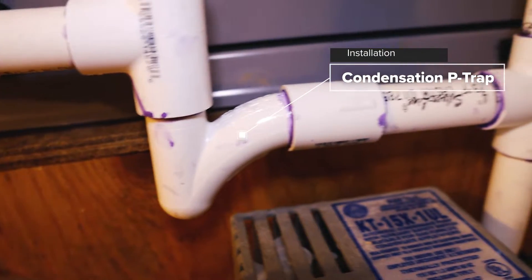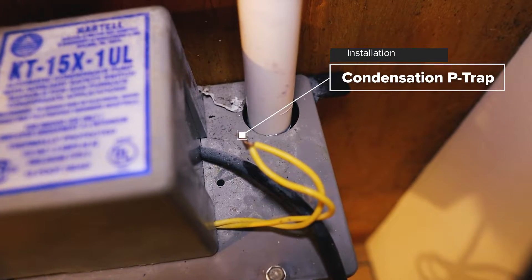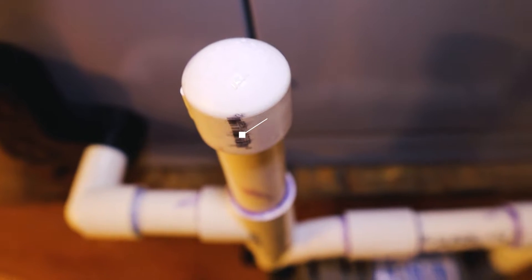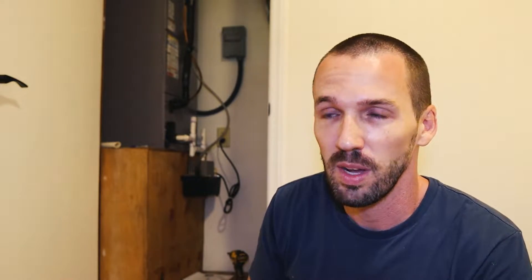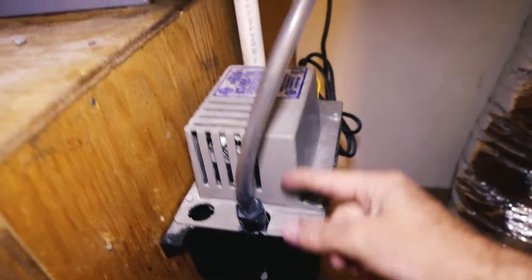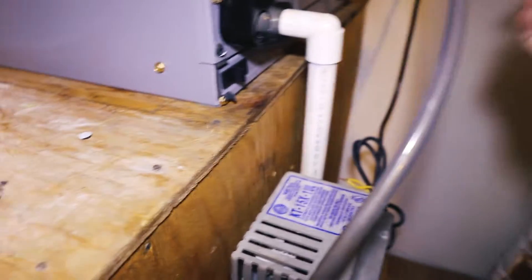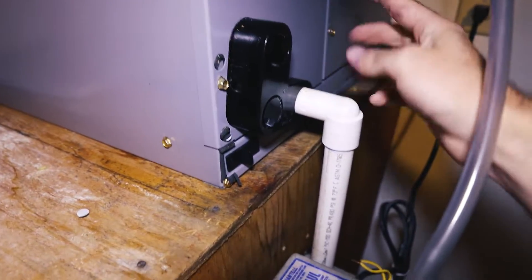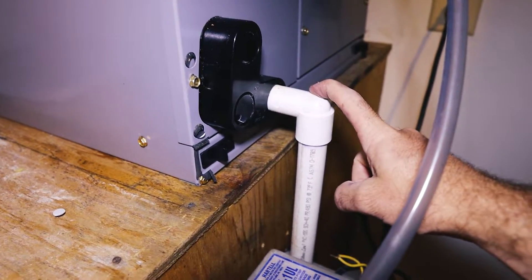Couldn't figure out why it was doing that. I'm going to show you exactly how it's done and how extremely easy it is to do. Here's my HVAC system. The condensation line goes straight down into this pump, which pumps the condensation all the way up through the attic and outside. The problem is that there is no P-trap here, so water just keeps getting sucked back into this unit. That's one of two issues, and this is the issue I'm going to fix today.